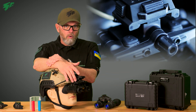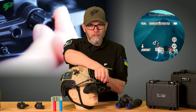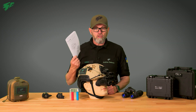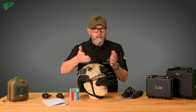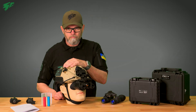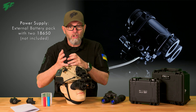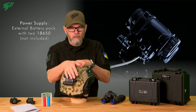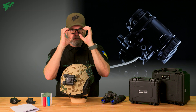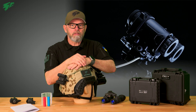The right button turns the device on and off. Just like regular NVGs, the middle knob on the housing controls the gain or image brightness. The Jerry FB comes with an instruction manual, two eyepieces, and an external battery pack including the power cable and a matching pouch. For use, you need two 18650 rechargeable batteries. You do have to use the battery pack externally, which on one side might not be so comfortable as a hand-held device, but on the other side it makes sense to build this on a stable platform like a tactical helmet.